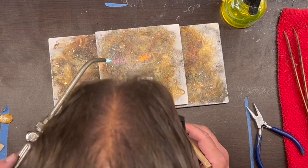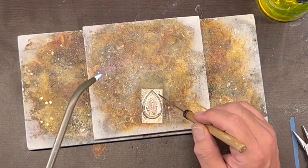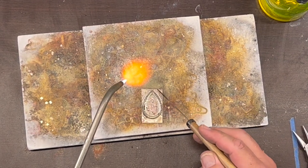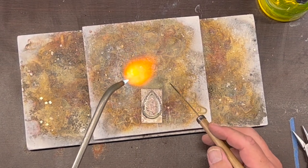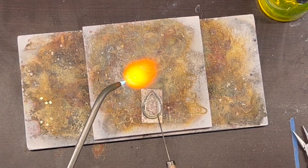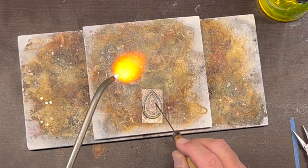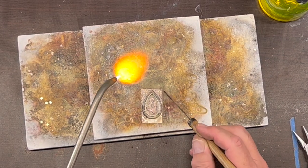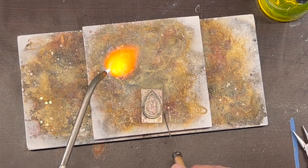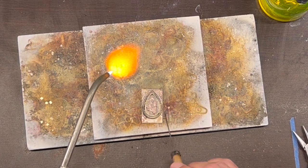So the other thing to know about this particular soldering operation is we're going to be oxidizing this gap in between the two of them with a solution, the stuff I use is called Silver Black, or they may have changed the name to Black Max. But either way, we don't want a lot of messy solder in there. And so when we place the solder that we're going to solder these two things down with, on the inside of the bezel, it doesn't matter if there's a little puddling of the solder. On the outside of this wire that we put around the outside, we're going to be trimming that excess sheet off. So if we put the solder leaning against the outside or touching from the outside, not much is going to go into the inside seam. And on the inside here, not much is going to go into that gap between there as well.